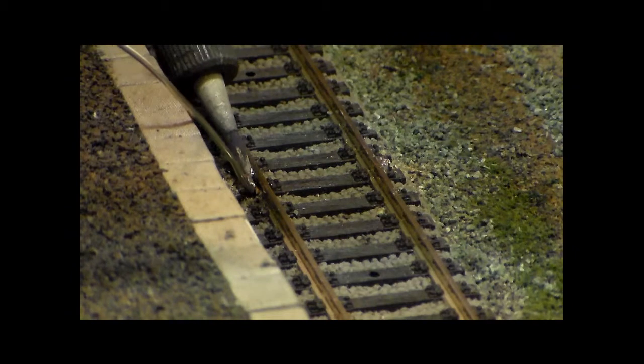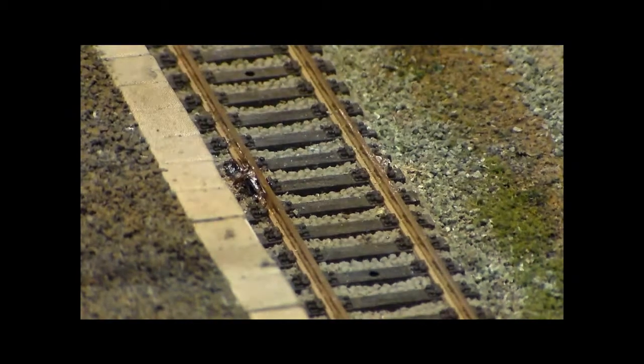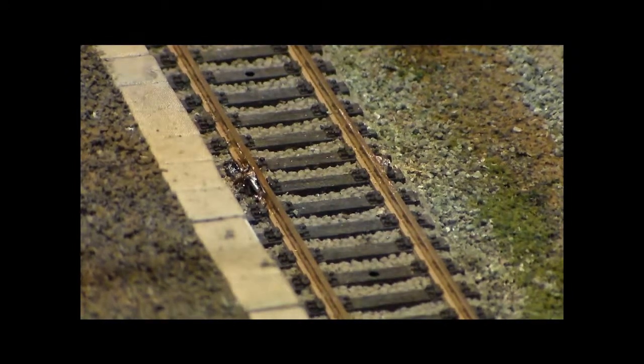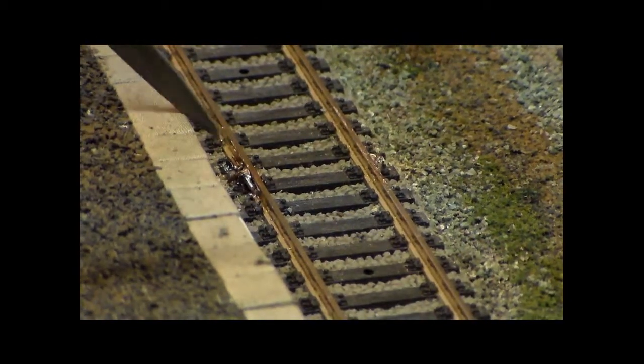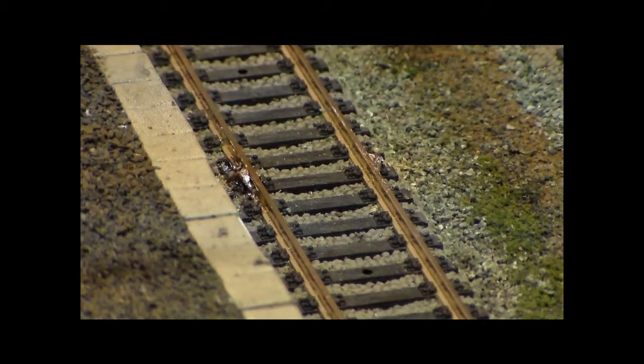It's not brand new out of the box. So getting the track warm, maybe a slightly larger solder blob than I really want. Because the wire was spring-tight against there, you don't want air gaps between the wire. What I do if it's springing away is use something like the file that I've used to clean up the track to hold the wire once I've taken the iron away. The solder doesn't stick to the file, but it just helps hold it in place so it doesn't spring away as the solder cools.